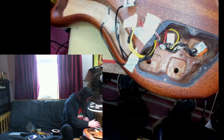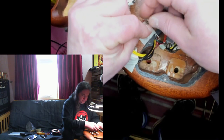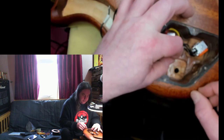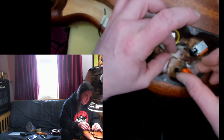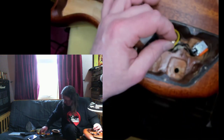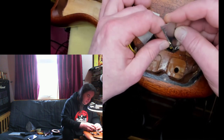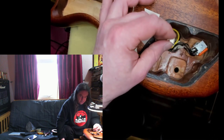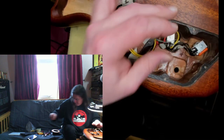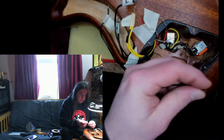Oh, it's got to do the other half as well — oh god, right, this is fun. So the output of the three-way, which was the white wire, has to go to the tone point. I don't think it's long enough... it's possibly long enough. I don't like it — I'm going to trim it and add a wee bit onto the end, taped on, just so it's got a good connection. The soldering that was on this was terrible — it was more burnt than soldered. If the wire isn't looking shiny I would rather not use it — this is the whole output of the whole guitar, so I want it solid.